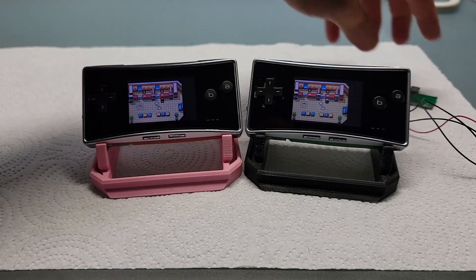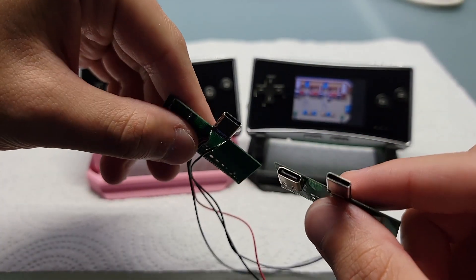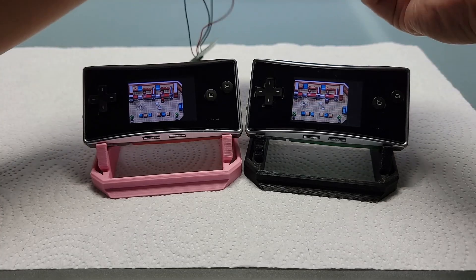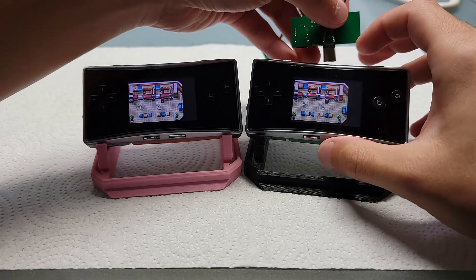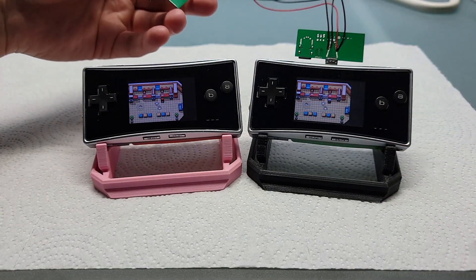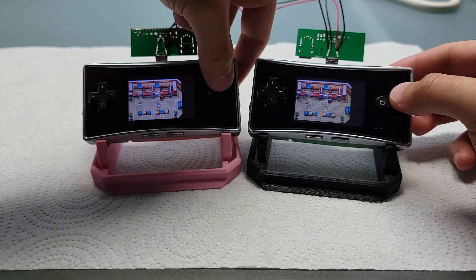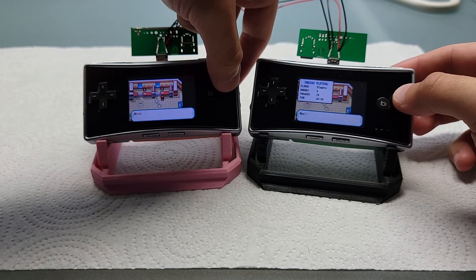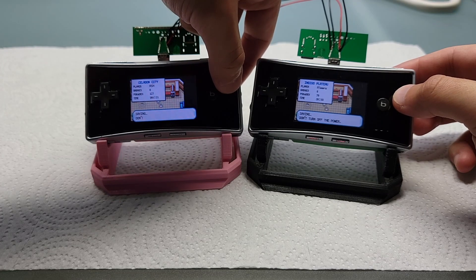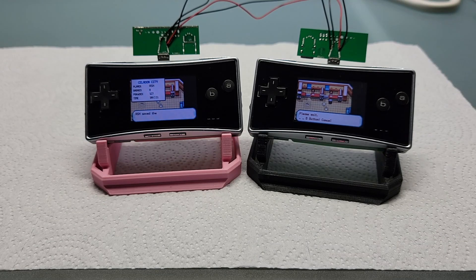Everything checks out. Here I'm going to demonstrate how you can trade between two Pokémon games just using these USB-C ports. They are connected with all eight pins of the micro port, so you will have the ability to connect Game Boy peripherals. The adapter here looks a bit strange — I did have a custom PCB made to make a USB-C adapter, but I got the pin-outs all confused and swapped around, so I have to use these boards I made custom to test different ports. I also use these boards for measuring and creating new PCBs.